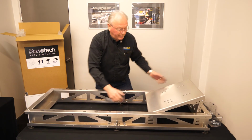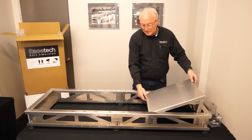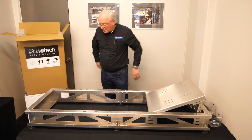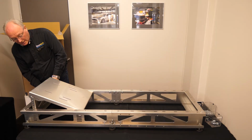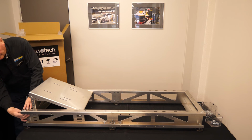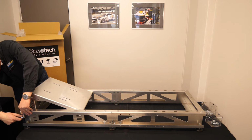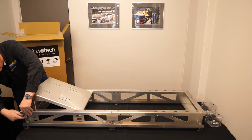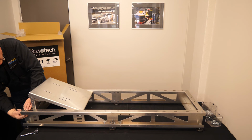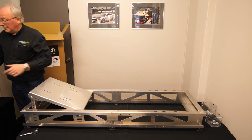Main chassis with the foot plate, as you can see it's quite adjustable up and down, or I'm not going to tighten it up yet. So the next thing is to put our pod back on, undo these two end bolts, the top ones only, which we left finger tight obviously. That was not finger tight. So one of the nice things about these flange nuts is they bite into the aluminium, so they don't need to be very tight. They're only an M6 bolt, so they actually can be quite loose.